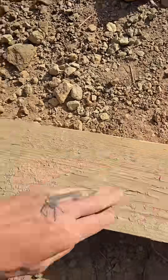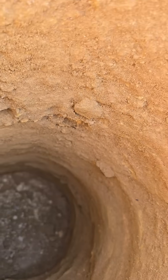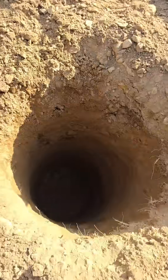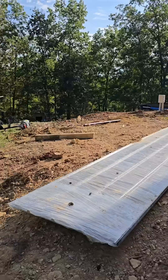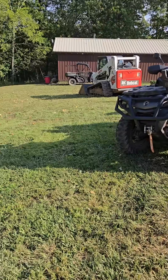I think it's because I'm building up on a hill and there's no real chance for water to get down at the bottom of these posts and soak for any reason. The posts are getting cemented in and I usually don't like to do that because it causes posts to rot off faster, but in this case I think it'll be fine. One of the big things I'm doing with this array is changing the angle.